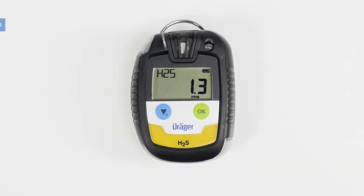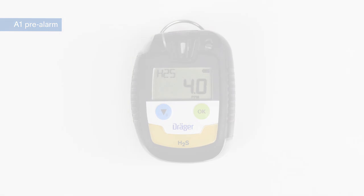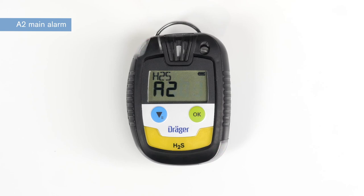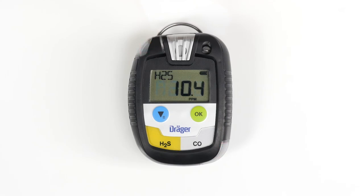The A1 pre-alarm is set off as soon as the concentration exceeds the preset threshold. There is no acute danger, and you can acknowledge the alarm by pressing the green OK button. The A2 main alarm indicates danger to life — when this alarm sounds, evacuate the danger area immediately. This alarm is not acknowledgeable. On the Draeger PAC-8500 with dual sensors, one gas sets off an A1 alarm and the other gas an A2 alarm, with both gas concentrations indicated alternately with the corresponding alarm icons.